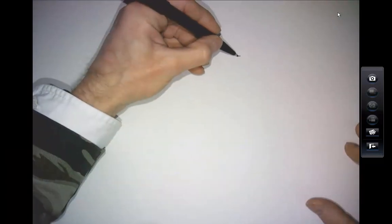What I normally do with any kind of detail is I like to start with structure. I'm going to start by drawing the structural member. I'll be drawing it at one to five — I typically detail at one to five and then maybe move up to one to two. I don't normally bother with anything smaller than that by hand because it's too fiddly.